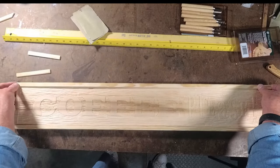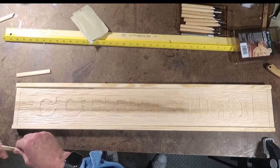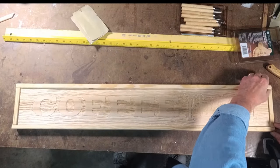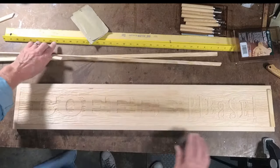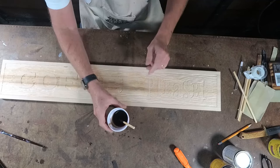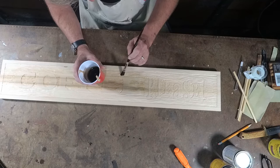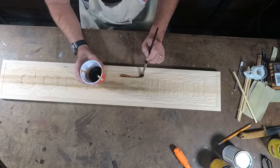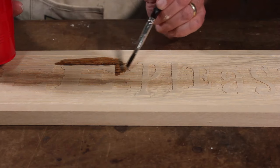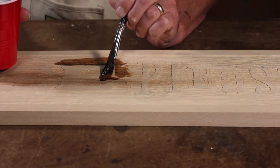It's a thin frame, but it's just going to be equal to the letters I've cut out and put on top of it. I thought about doing a 45-degree cut on the corners but I think just doing straight cuts is going to work just fine. I mixed up some Minwax stain — it's a transparent stain and I blended a couple colors together to get the color I want. This is going to work great. When you're putting it down you want to paint around the letters, but it doesn't have to be perfect — you really want it to bleed into the letter a little bit. What you want to do is leave enough raw wood showing so that when you come back and glue the cutout letters you've got some raw wood to connect to.